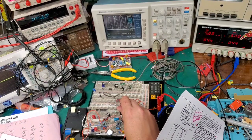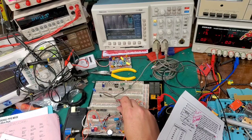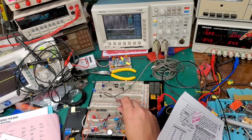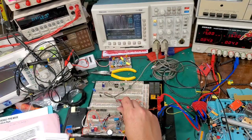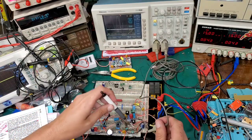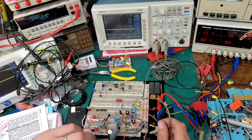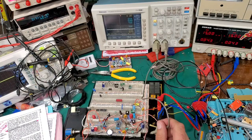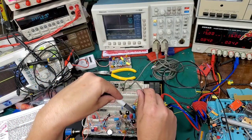It's got a signal that's 7, 8 volts compared to the one over here that's 500 millivolts. And over here, I don't know why it's picking up the swishing noise still. I tried to find that peaking and get rid of it for like 3 days, sadly, and couldn't do it. So finally, I just said to hell with it. I took a lead from this one, put an amplifier up here, and used this to drive a filter whenever I got the exponential ramp finished. But anyways, up here it still manages to find a spike.